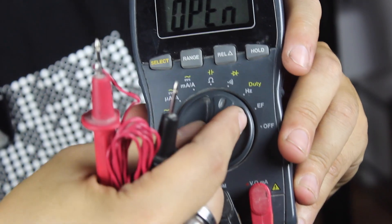The last thing I'll use is the resistance check in ohms. The reason I might use this, although not frequently, is to confirm that resistors I get from a bargain bin actually match the color code on the resistor itself — I've had some that don't, which makes no sense to me. The other thing I might use this for is if I have a potentiometer — an adjustable resistor — and I have it dialed in to make a circuit or a light the exact intensity I want. I'll take that value from the pot, meter it between the LED and its voltage source, and see what that resistance is for the LED so I can just get a fixed resistor instead of using the full pot. That way everything's dialed in for the temperature of the room and those lights.